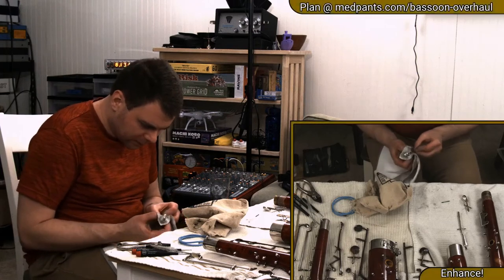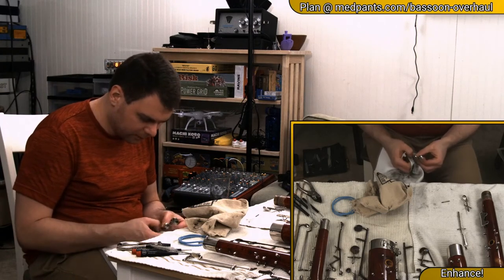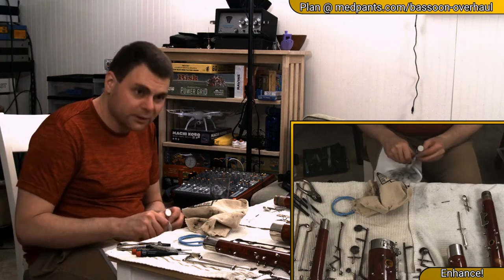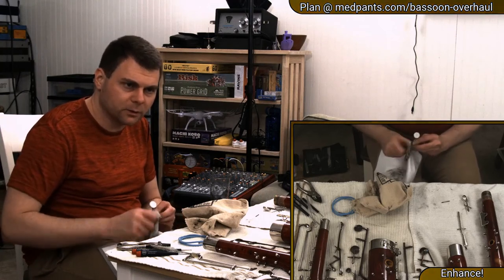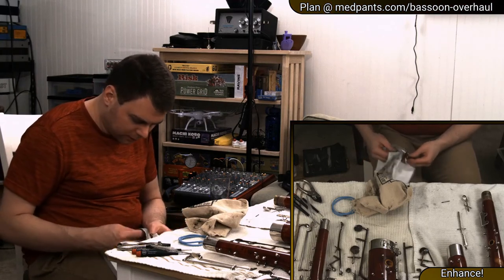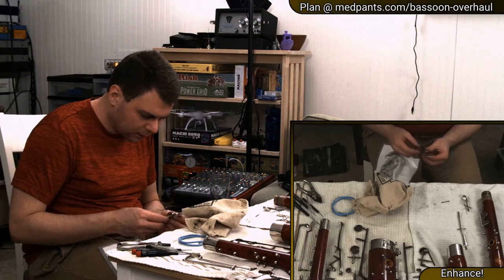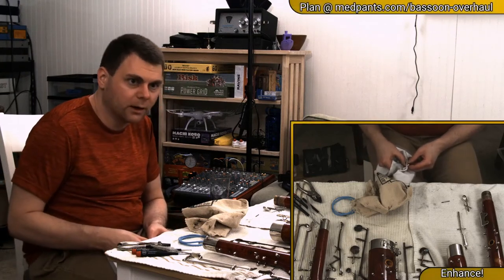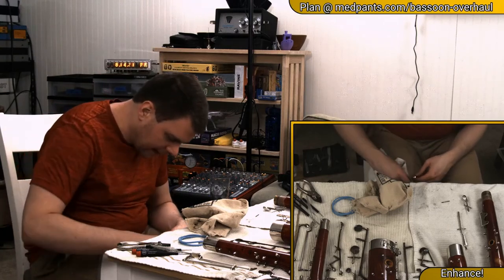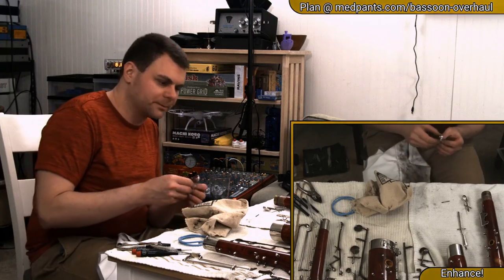You do have to be a little careful with this kind of spring, with these leaf spring things. They're usually held on by a screw, and that little screw is driven into the metal, tapped into it, presumably. But it's a very small screw, and the metal that it's attaching to is somewhat soft metal. So it's not super hard to strip that screw out, especially if you're having to take it out and put it back in. So it's worth being a little careful about it, and if you ever do have to torque those screws down, be gentle with the amount of push you apply, because they probably don't take a lot extra than what is required to make them tight before they start stripping.